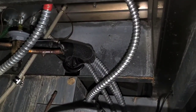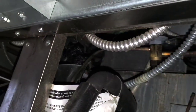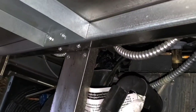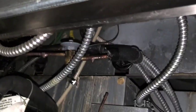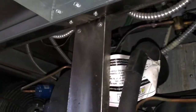We've got the rail over here and the rail over there — see the little two plastic grommets that it all goes through. Apparently the refrigerant is metered only for this one side, and the entire other side is all suction line now because of that sensor bulb being moved. Every bit of this was tech support's idea. Mashed Potato Johnson came here, called tech support, they told him it's overcharged, told him to move the TXV sensor bulb, and apparently told him about the cap tube.